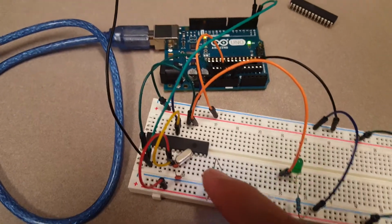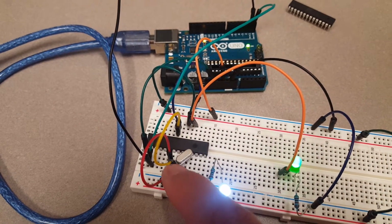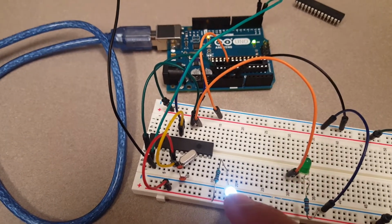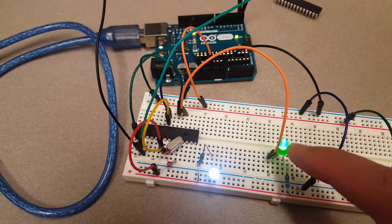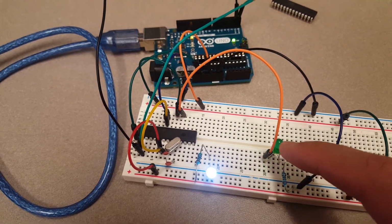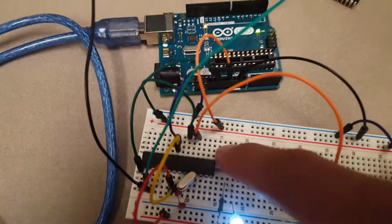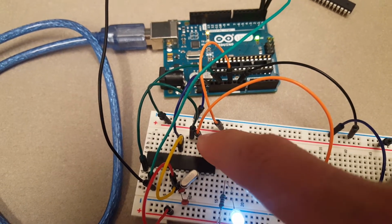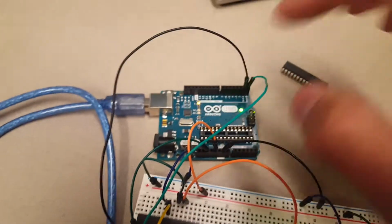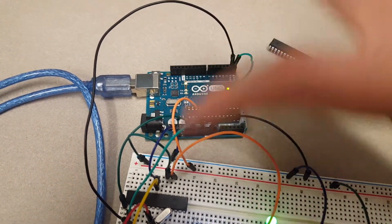So this one will be portable, and it has the oscillator, which is a 16 megahertz oscillator, and two capacitors, and a little LED. It's a power indicator, and this other little LED is blinking. I connect this one to this port. So on the right side, the fourth port from the bottom. This one is actually port 12 on the Arduino board. Okay, just keep in mind.